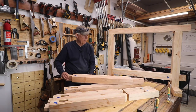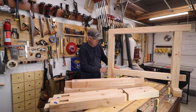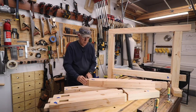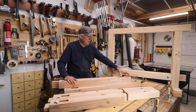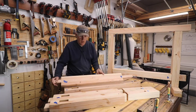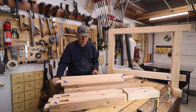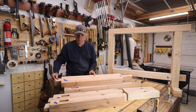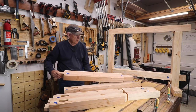The second piece is the bottom rail. It's designed so that one end — the tenon — goes through a through mortise and aligns with the edge of the workpiece. One tenon is shorter; the other tenon on the other side is aligned to go all the way through and is twice as long. I do some dimensioning on them to get them down to about one and a quarter by three and a quarter, and then start putting the pieces together. It's one piece down the middle of a certain length with two rectangular pieces simply glued onto the longer piece.